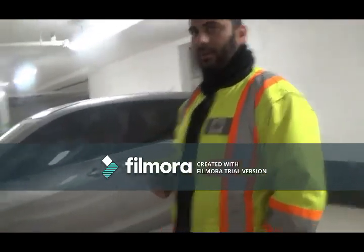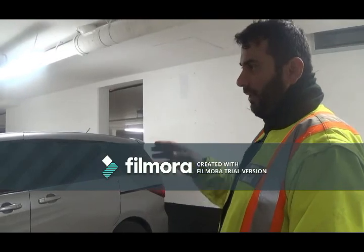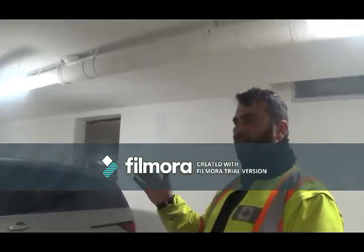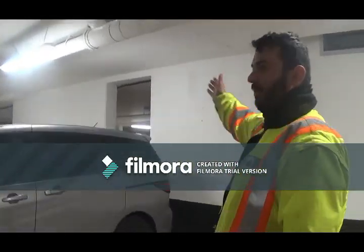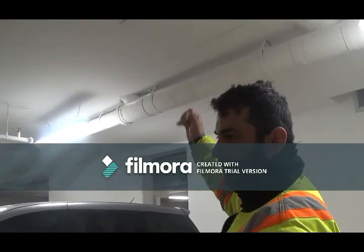The shut off for the risers. Okay. So the heating system, the fan coil system water lines, the supply main, is half on the ground and half starts in P1, because half the suites are on the ground floor. So on this half of the building, this is where the suites are. In each access door, there's either a valve or a cleanout for the plumbing sanitary system. They'll have a valve tag on it. I think we even wrote the riser number on the insulation, so you'll have to look it up. But that's pretty much it.